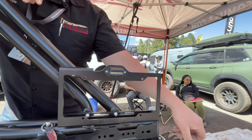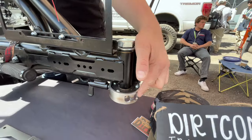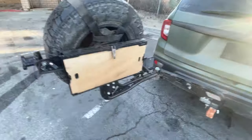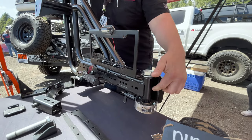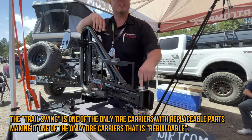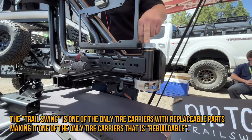We offer this adjustable latch here, which is a stainless steel piece that's bolt on. And this is a 1-inch bolt that has oil embedded brass bushings in here, so they never wear out the actual hard parts. They'll actually just wear out the brass bushings.